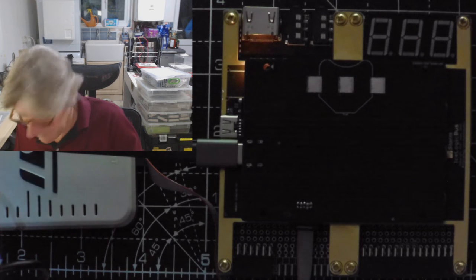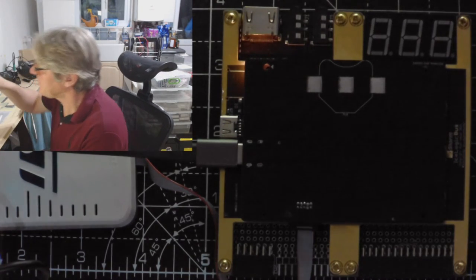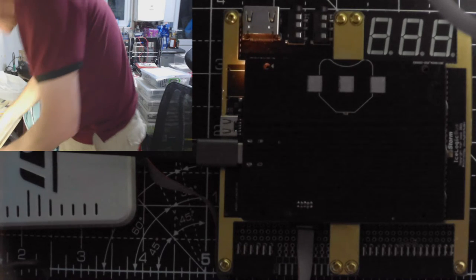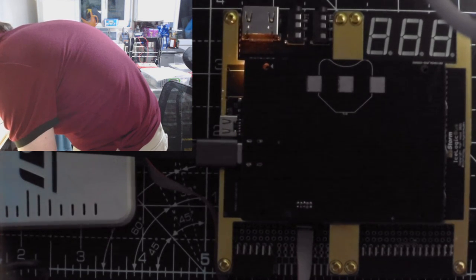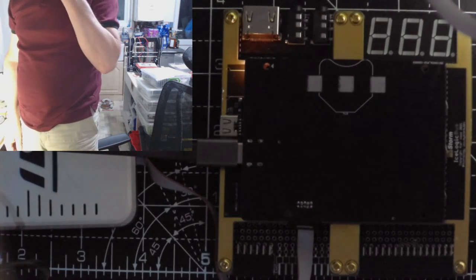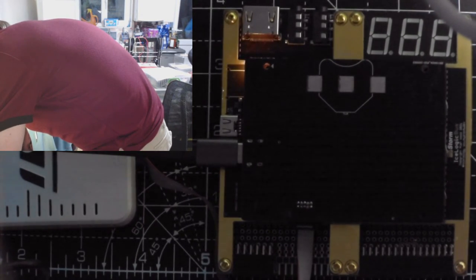Let me just have a quick look under the microscope at the blade contact to see if there's an issue. Bear with me. I'm going to look under the microscope at these because I wonder if there's an issue. The actual contacts. Oh, they look a bit shit. Remember I said that I forgot to take the paste mask off? Well, if you look closely under the microscope, you can actually see blobs of solder. I clearly didn't do a good job of cleaning the paste off. So there are bits of solder on it. Maybe that's making it worse.